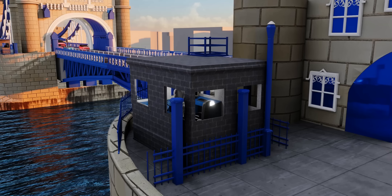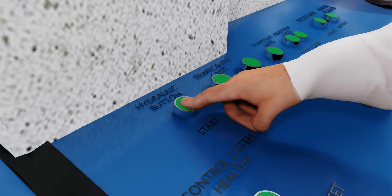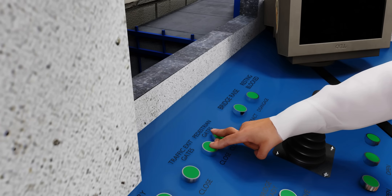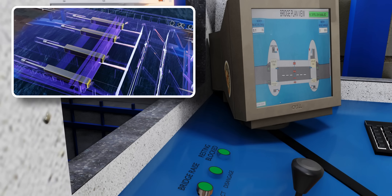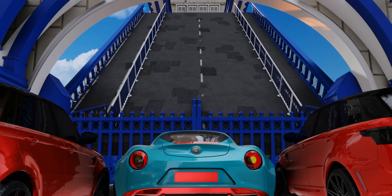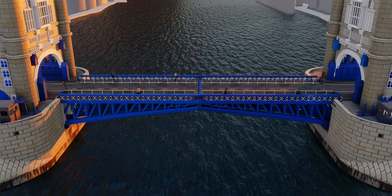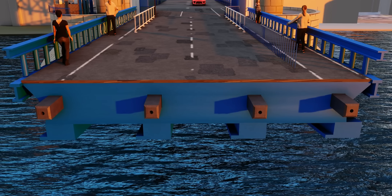To understand the details of the Tower Bridge operation, let's get into the control room. The first operation for bridge opening is to start the hydraulic pump and pressurize the liquid. The operator then makes a public announcement and turns on the red traffic signal. When he presses the fifth and sixth buttons together, the gates close automatically. Next, he presses the nose bolt button, and a joystick controls the opening of the bridge. Once the ship has fully crossed, the operator closes the bridge. Just by looking at the details of asphalt and structural steel, you'll be able to appreciate the intricacies of engineering done more than 100 years ago.